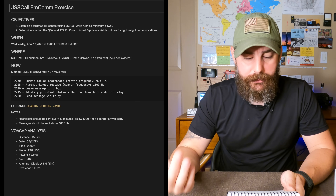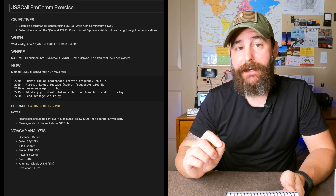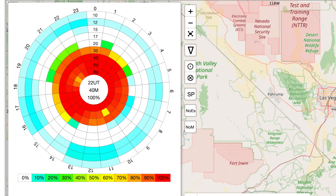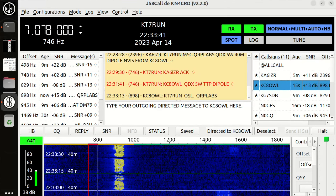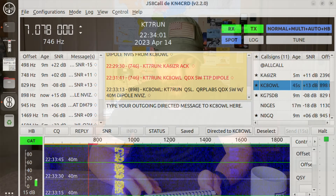I like to put down when: this was the 12th of the month at 2200 UTC. I selected 2200 UTC because that was the time we had close to 100% prediction success reported by VOACAP. Who was involved? Obviously me and Mike KiloCharlie8 OscarWhiskeyLima. The how for this communications plan: JS8 Call, and then the band and frequency. We wanted to be on the 40-meter band and specifically use the JS8 Call calling frequency on 7.078 MHz.